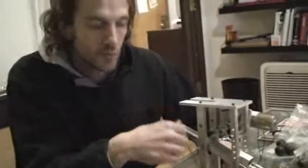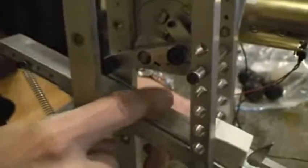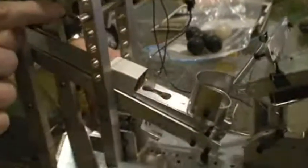All right, so let's go over our prototype. It's October 26. The motor drives this wheel here. These are cam rollers here, which push this arm down against these springs. Up at the top here is a limit switch that basically every 180 degrees tells us to stop again. So it rotates down, pushes this down until the latch catches and then gets out of the way.